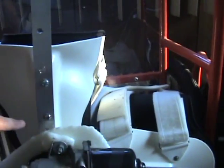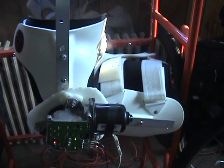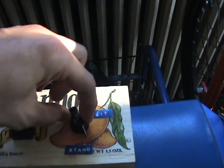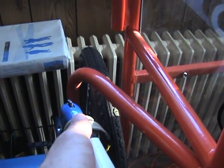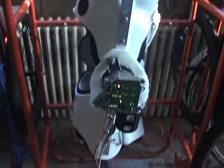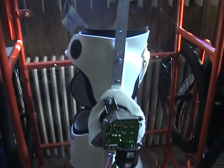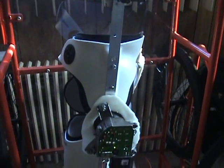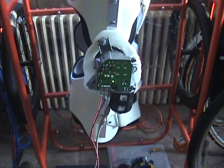Right now the unit is in a sitting position. If you can imagine, this is the torso of the user and right here would be the thigh — so as if the user were sitting and wearing the device. At the control box we're currently in sit mode. You can change it to stand mode, and when we apply some pressure on the FSR you can see it go into action and basically straighten out into a standing position.